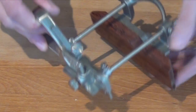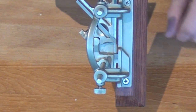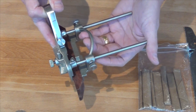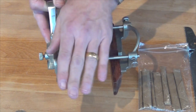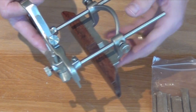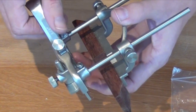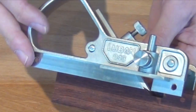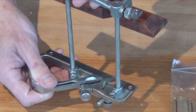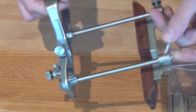There's a decent rosewood fence that's been added onto the metal fence here, which if necessary can be easily removed with a couple of screws. There are occasions where you would want to remove that. The fence closes right up on the skate — no problem at all — so the tolerances are good enough for that. It slides out and gives you just over 4 inches of width. There's a recess in the fence to allow shavings to escape quite easily. All the screw locations are quite well placed so as not to get in the way when you're using the plane. The plane body itself is cast in stainless steel, so you've got no problems with corrosion. Generally, it looks to be well cast, well finished, well machined — no obvious problems there.